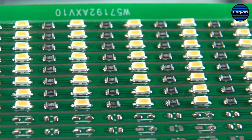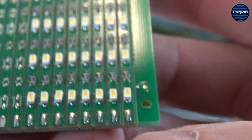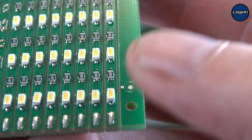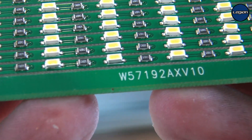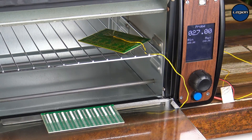Let's pop that open. The solder has definitely flowed, but they look quite ballish. So that was our first actual real use of my toaster oven, and it looks like it's done a good job. The ChipQuick solder paste looks a lot cleaner and shinier than the Mechanic brand that I was using before.